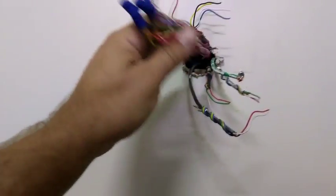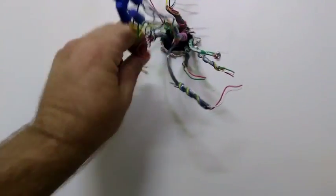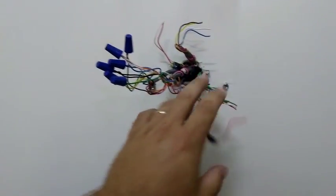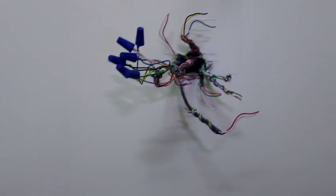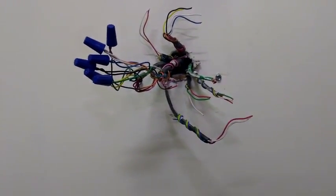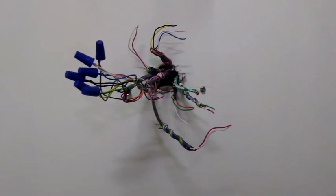My panel is taken off the wall. I had the wire coming in from the zone 1 stat, and had to wire in a reversing valve wire. You can go onto the equipment, and I'm just going to leave this out for a second while I'm testing. All this other stuff is going to be useless junk now: transformer, sensor, and damper wiring, as long as the dampers are normally open. I do believe they have an adjustment where I can lock them in place anyway, so they can just sit there and be open forever until someone wants to take them out somewhere down the road.